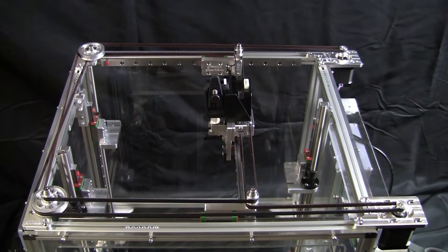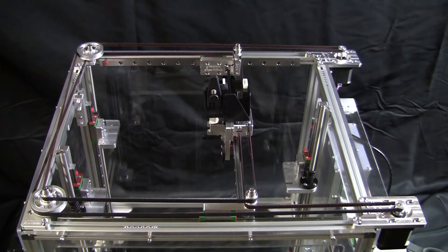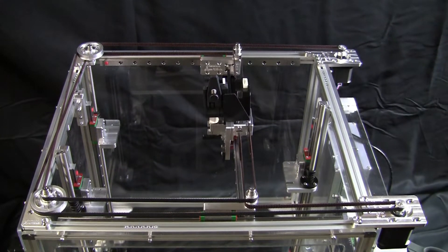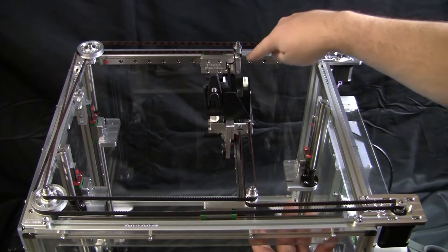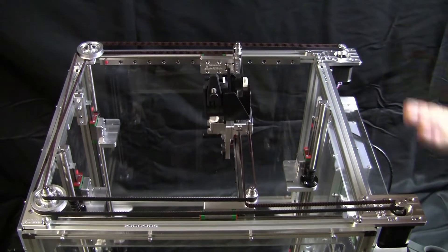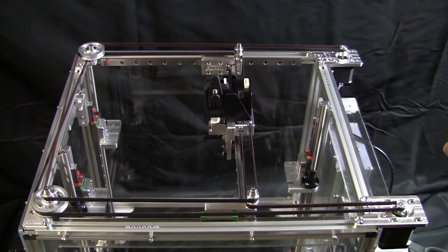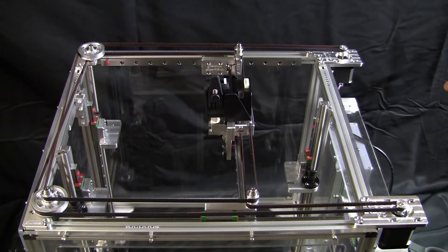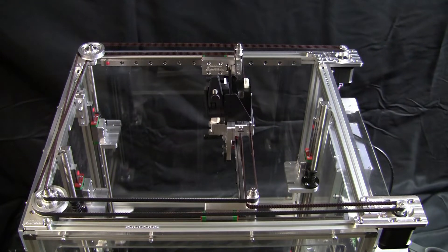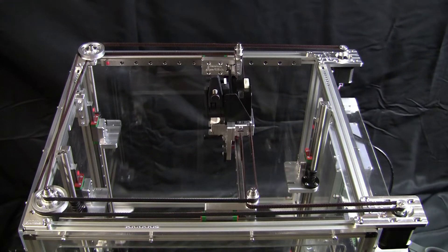This is the belt layout for the Rail Core, and I'm going to be going through a video demo of how I align the two X carriages so that they're parallel. This is the initial belt configuration — I have not adjusted any of the height of my pulleys or anything like that yet, so it's just kind of box stock. This is a Rail Core 250 ZL that was someone's self-sourced build and I bought it from them, so I'm getting it up and running. It being nice and clear makes it a good video platform to show some of this.